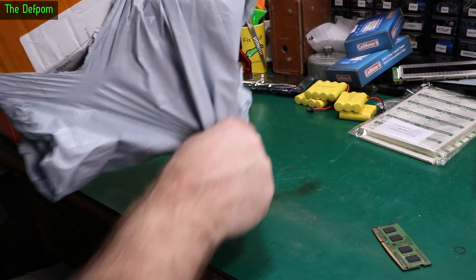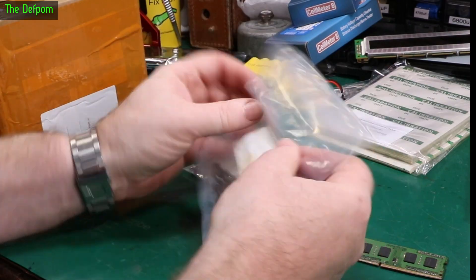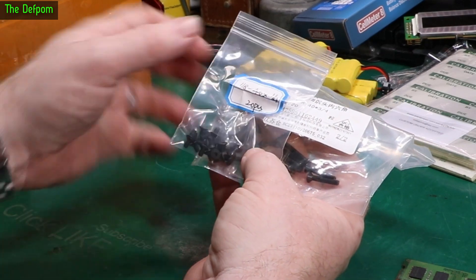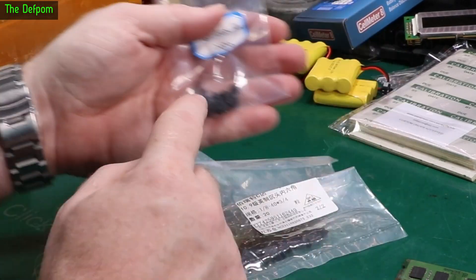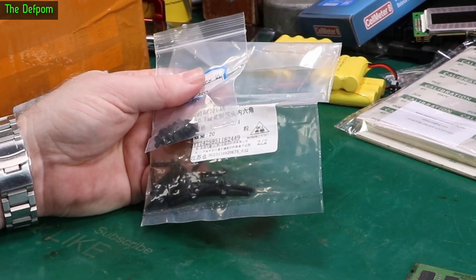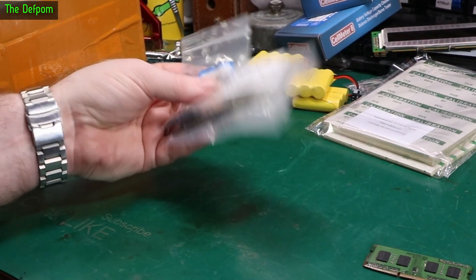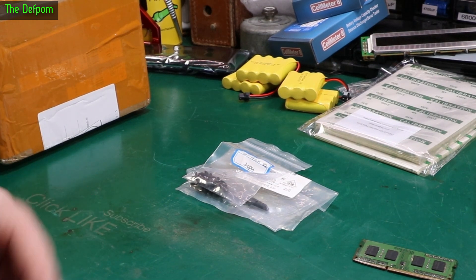You're getting a twofer. These are some screws — quarter inch and one eighth. One eighth by 40 threads per inch by one quarter inch long, and the same at three quarters long. The reason I've got some imperial ones is because a lot of test gear, like HP stuff especially, uses imperial screws, and all my stuff is basically metric. I've got very few imperial screws or bolts. If someone knows what size HP tend to use in their gear, perhaps you can tell me — I'm just guessing.